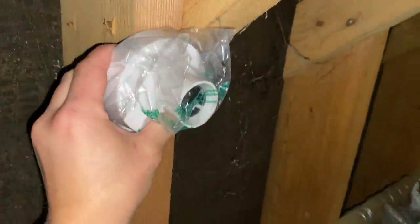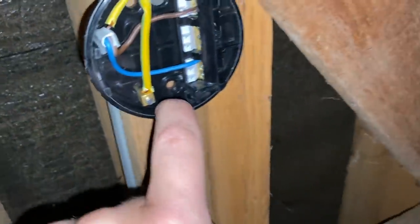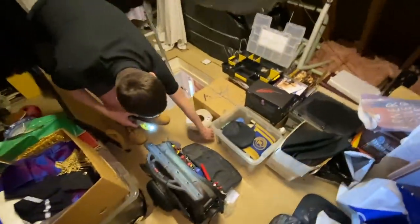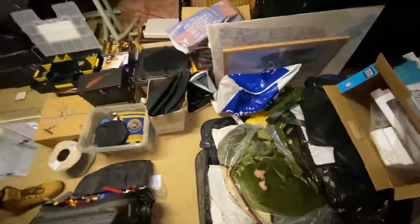I think we're going to go with one here to be fair - that's going to look all right. It'll reduce wiring and give us good coverage. We don't need to light up that far end, so just down here clipped along this beam. Easy peasy - live and neutral, keep it nice and simple. I've gone for Crabtree, bit better quality - just clipped down, runs along to the existing light. James has gone to get me another screw, and comes back with a boiling hot coffee - cheers James!